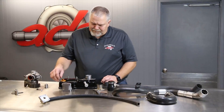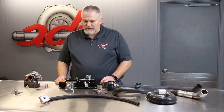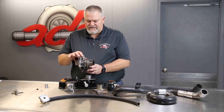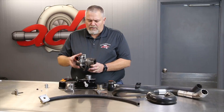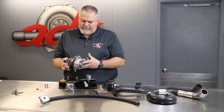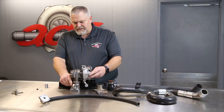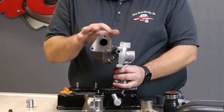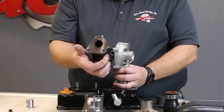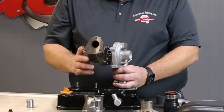We'll mock this up kind of like it would be on the tractor so you get an idea of what's going on here. We also repositioned the turbocharger — re-drilled the exhaust housing to bolt it in the proper location, and oriented the compressor housing so that it will be repeatable. The oil drain flange we've made also has a machined flat plate where we can weld a straight piece into it to get the angle we need, since that's all done on the CNC and we can therefore maintain the proper angle.